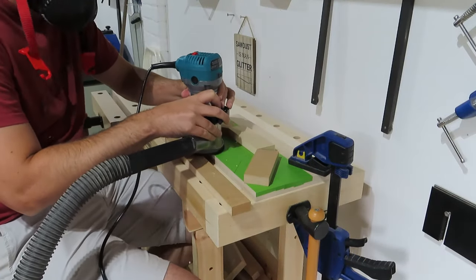Next I just trim up the edges on the table saw — and I mentioned that's the sled from my previous video. I used some slightly wider cherry edge banding here, just to hide the joints where the two panels meet. Now I think we're all done.